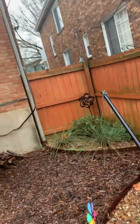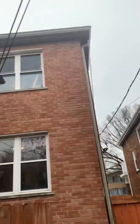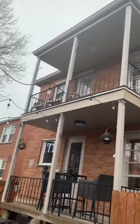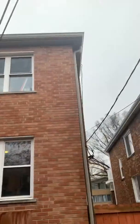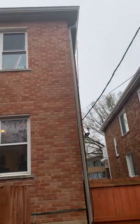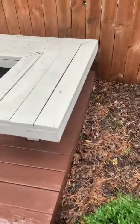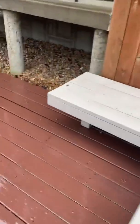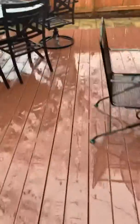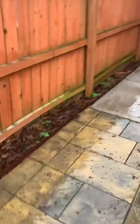How we're going to bring the line set up is the biggest thing. This is all finished off — looks really nice. I don't know if we want to disturb that. We can probably try and get into one of these corners and do like a downspout coming down, or, because he's doing so much renovation, just taking a chase, taking the line set up a chase. We got our plumbing and electrical working with us, so we're probably going to run it up in a chase with them.